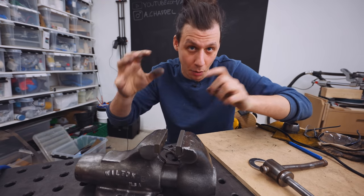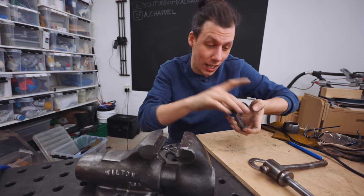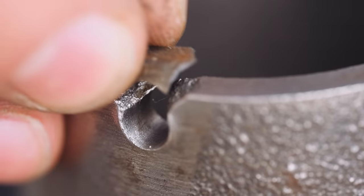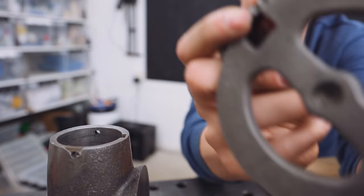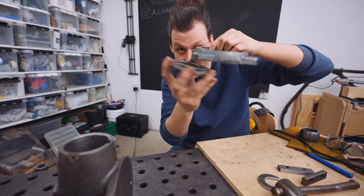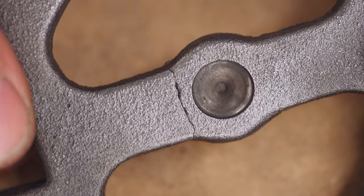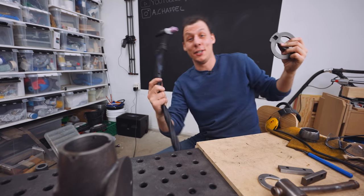Before we do that, there's a little more work to do. The jaws don't sit flush and there are damaged areas with holes and dents. I want to machine everything nice and flat so the jaws have a square area to sit against. But first I want to repair the main broken areas — the damaged castings, a little piece that broke off in the back, and most importantly this piece that locks the rotation of the base, which has a solid crack straight down the middle.